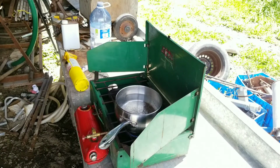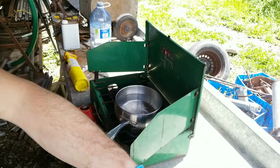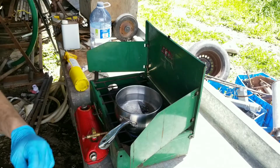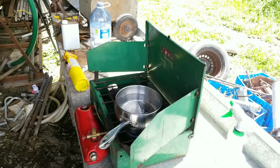Remember, this is a how done, not a how to. And into the drink. There we go. And we're going to let them boil for about 20 minutes, well, they'll be at boiling temperature for 20 minutes, and that should seal up the pores and create a continuous anodized layer so that we have the durability we're after. And we'll check back in a little bit.